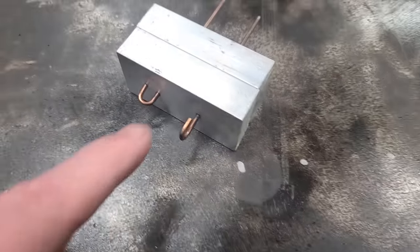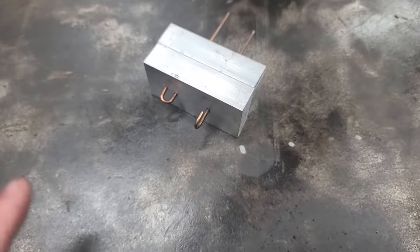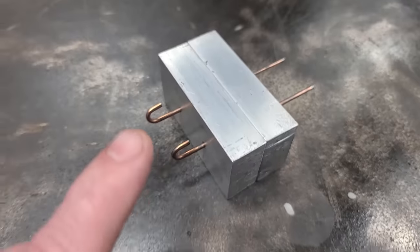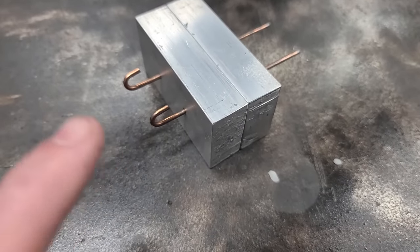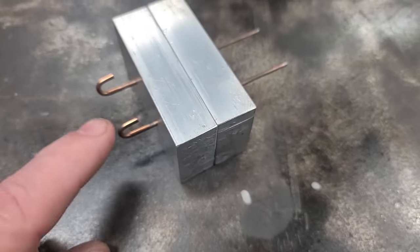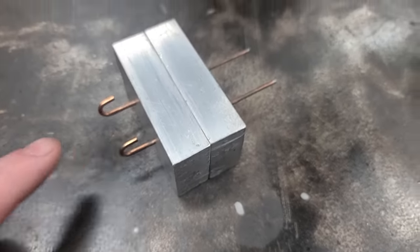That's what we want. Next, we're going to have to start drilling the shape of our sinker, and we're doing an egg sinker. Now, the good part about this next step is we ain't using them tiny little drill bits that are going to keep breaking on us. On the next step, the first drill bit you're going to need is a 1/4 inch drill bit.